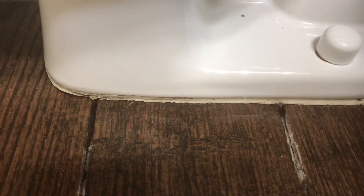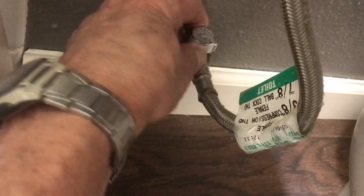I'm going to flush the toilet and if you watch both of those grout lines after I flush, you'll see water starting to come out. There it's already started on the right — see it there? And over on the left it's actually coming out underneath the caulking on top of the grout line.